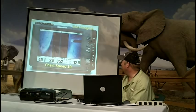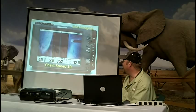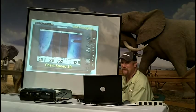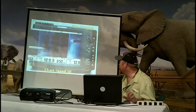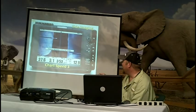This is basically showing us distorting the image by cranking up our chart speed. This is probably the number one thing that I see people do wrong — they run their chart speed fast, so their fish returns are long and their data is all stretched, and a lot of detail is missing. Matching chart speed to boat speed will give you a lot better detail in your image. In this next image, you can actually start seeing all those little rocks, the bridge piling exactly as it's represented, and the fish in the exact shape that they're represented.